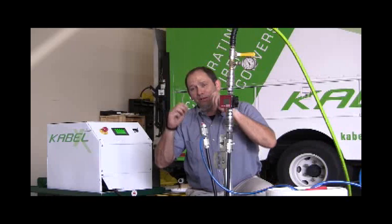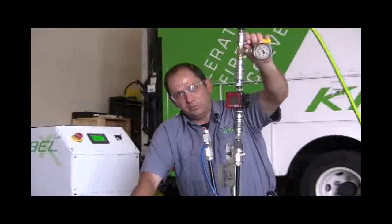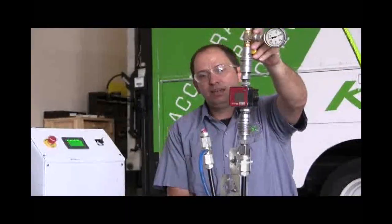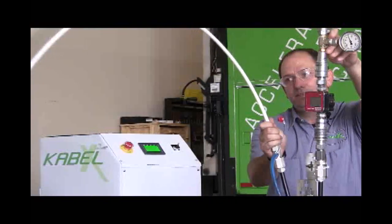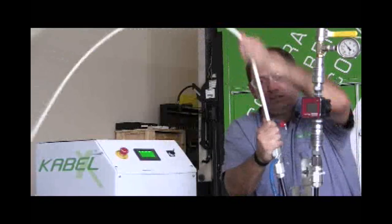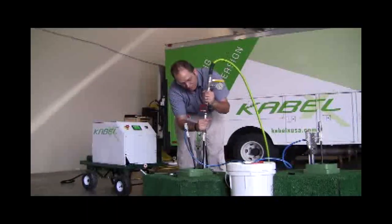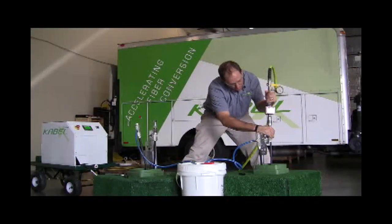Before I do that I'm going to put on my safety glasses. Now that I know it's not going to leak, I'm going to crack it open all the way and we're going to be ready to extract. This won't take long. And there it is. As you can see, our core comes out quite easily and it's not messy at all. So with that I can actually switch over to my other section for our ped-to-ped and we'll extract that piece too.